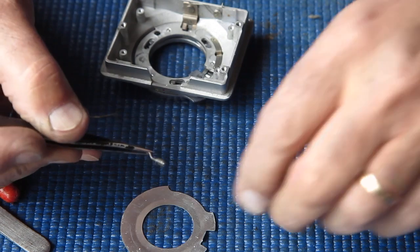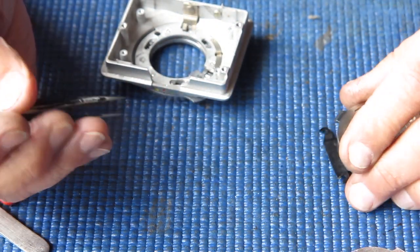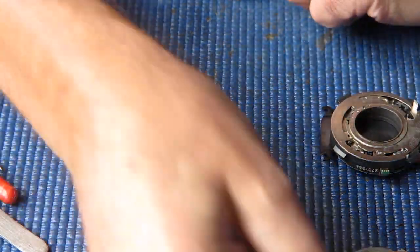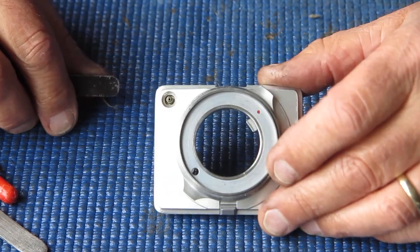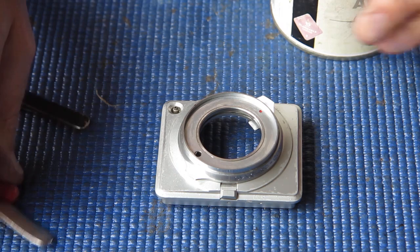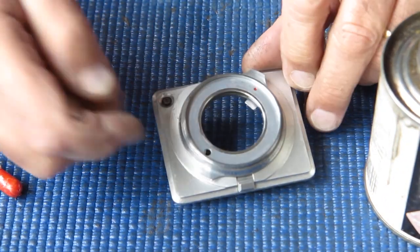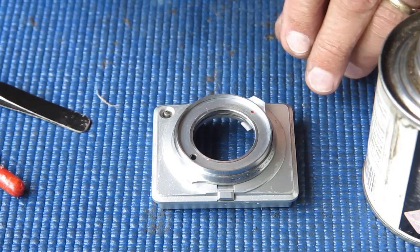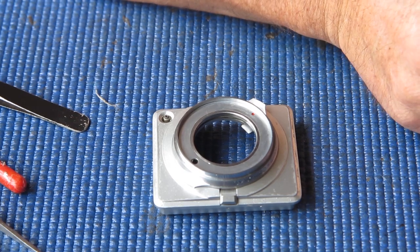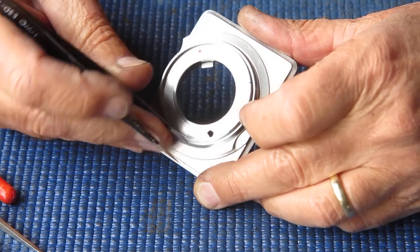Here's our coupling for the rangefinder. This pin is loosely threaded into this section at the bottom - do not fiddle with it or adjust it by tightening it up. Leave it alone; it's probably adjusted correctly. So here's our mount. This trim ring is just glued in place. The easiest way to tackle it is to take some solvent and drop it around the outside edges, hoping that it dribbles down underneath that plate. The plate is only thin and easily damaged, easily bent - it won't look pretty if you make a mess of it.